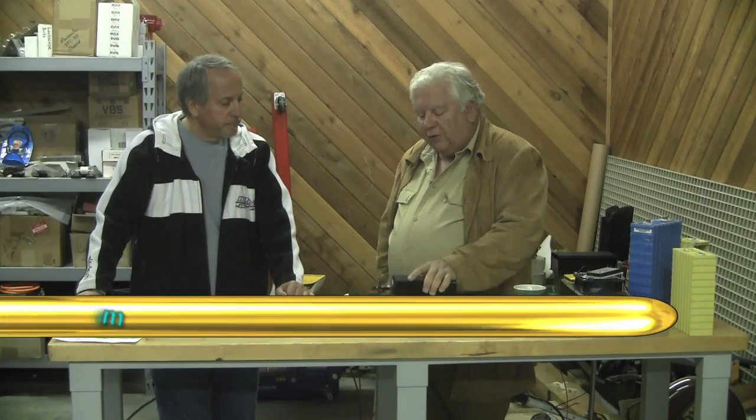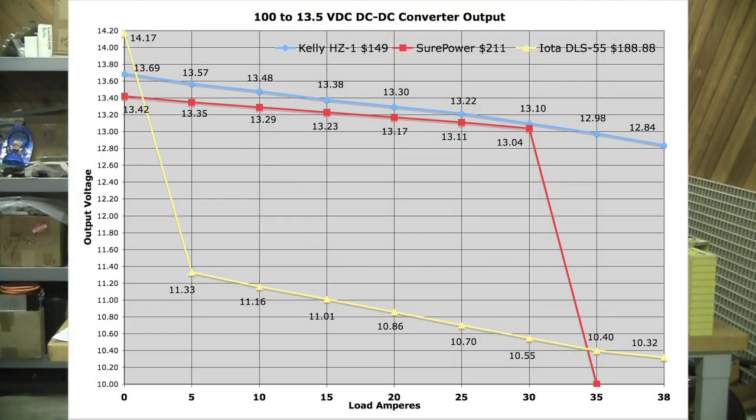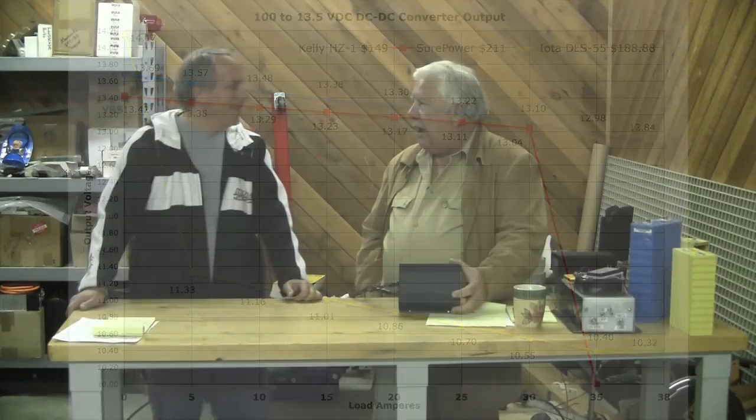Again, it does 13 and a half volts. They have them in a bunch of different sizes. The input voltage range is not as wide. This is a 108-volt model, works down to about 95 volts. We tested it at 112 and it works fine, so it's got a little bit of range — just not as wide a range as the SurePower. At 100 volts input on this 108-volt unit, the most current I could test was 38 amps. This thing's still doing 12.8 volts and putting out 38 amps, and I let it run for a half hour and it didn't even get hot.